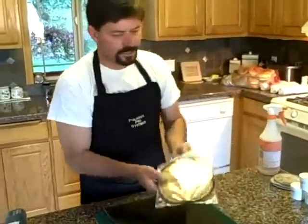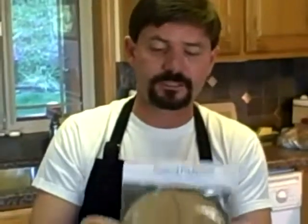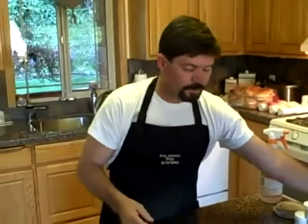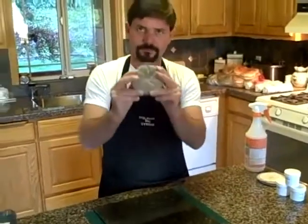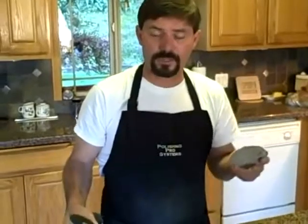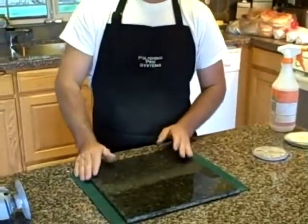In your kit, the standard kit, it comes with a 6-inch pad. The 6-inch pad will facilitate the same process. Remembering, we have to turn this at 10 to 12,000 RPM. For the purposes of this demonstration, I'm going to use our smaller pads fitted on our smaller grinder, turning at 12,000 RPM. This will accommodate a smaller area.